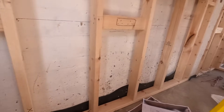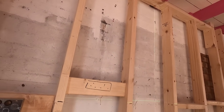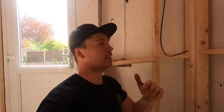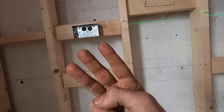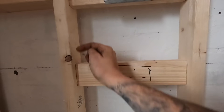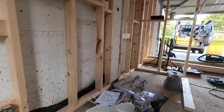For the three single sockets down here and the cooker socket, we can screw it to the back of the pillar since it's going in the bottom of the cupboard. There's also an under-cupboard light coming on top of a flyover. The grid switch will have three ISOs in it with the feed in, feed out, and loads off that. We're going to bring them around and clip them to the back side of the wood - we don't need to do one for the cooker because it's fed through into the cupboard.